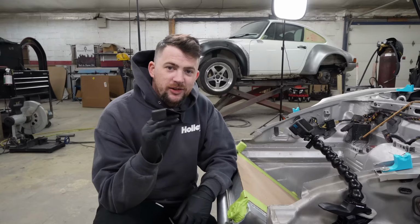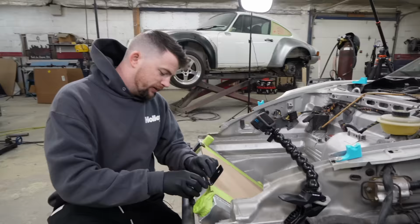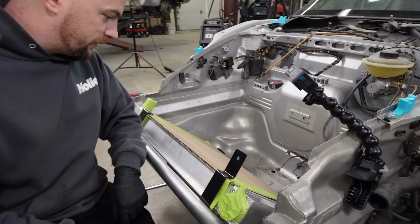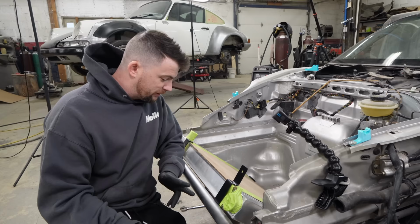Yes. I like that. So in the same kit of radiator brackets, we have these uppers or lowers or whatever they are as well. Obviously, these brackets are very basic. However, they're good bases to work off of. So I have an idea here. What I'm going to do is take this bracket, lop the tail off, or go on top of the radiator here, and use the tail to go to the top of the tube, nutsert that, bolt it in, and that'll be our mounting. That should be basic and straight to the point. Hold it in place, which is what it needs to do. Exactly. So rather than talk about it, let's be about it.